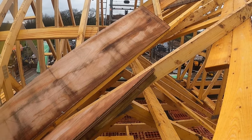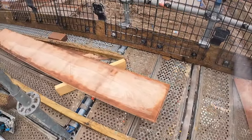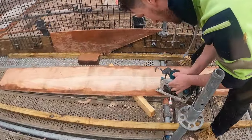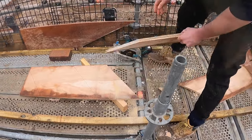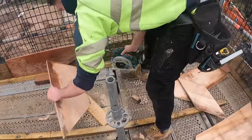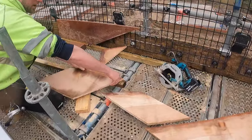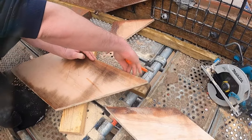Also while I'm here I'll mark the trusses and then I know where my nogs go. The angle on this side is different, so we'll try and keep the wood separate because we know the offcut of that will carry on up the right side and the new offcut will do the left side. Number one — how do we do the nog? So keep it flush to the long edge. Basically the edge that you haven't cut is the edge that you put your timber to.